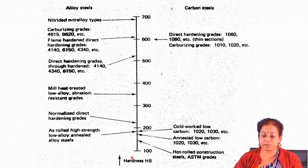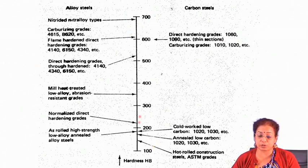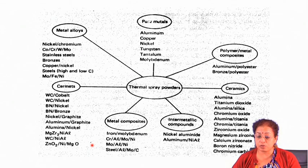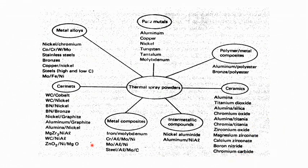Hardness is a very important parameter. A large number of materials are available with a wide range of hardness values, starting from typical low carbon steel up to nitride alloy or carburized grade steel, ranging from around 100 to 700 HV. For material selection for a particular application, you choose the material based on the required hardness, so whenever you need wear resistance you can choose the proper material with the desired hardness.